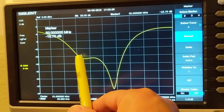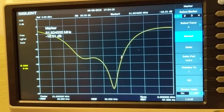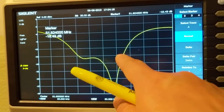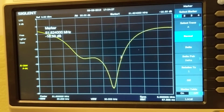At the 1.4 SWR mark, let's see how wide it can cover. It covers up to 51.82 megahertz. So basically this antenna is good from 50 megahertz to about 51.8 megahertz — anything above that is not as good. This is pretty good performance for the six-meter band.